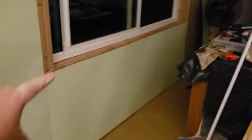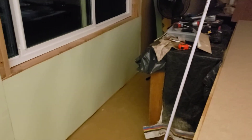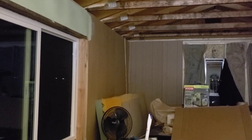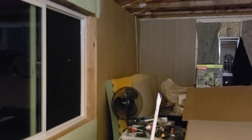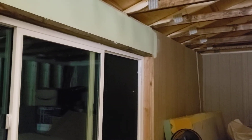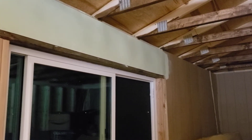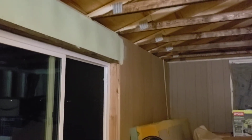Because I didn't really take it seriously. So when you put up paneling, don't just put it up and think, oh, I'll get to it. Because see the ripple down there? Just don't tack it up. Make sure to put it up properly the first time, because if it gets at all humid, this stuff is gonna buckle on you. I should have tacked it down properly the first time — that's a learning lesson.